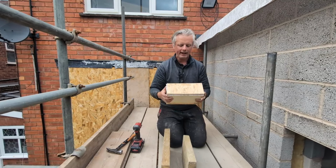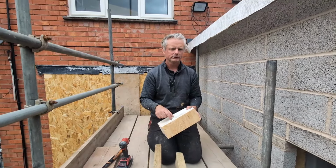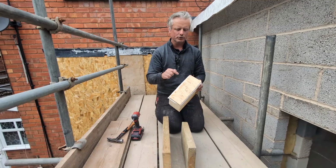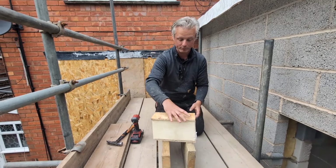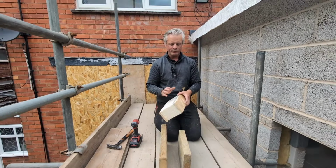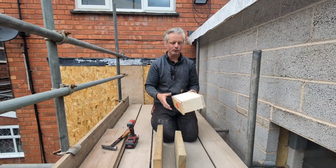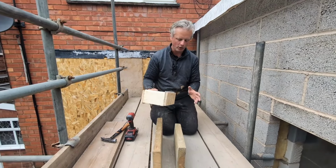That's the theory. However, how many fixings are on this roof, Rich? It's got to be more than 100, I reckon. More than 100. And this roof isn't that big, really. No. If we were to drill or screw through 100 holes through a vapor barrier and just wherever we wanted to put them, we wouldn't find a single rafter. Are we really suggesting that every single one of those holes is self-sealed and that vapor barrier is as good as it was before we put anything through at all? I don't know for definite, and I'm not going to put my faith in it 100%.